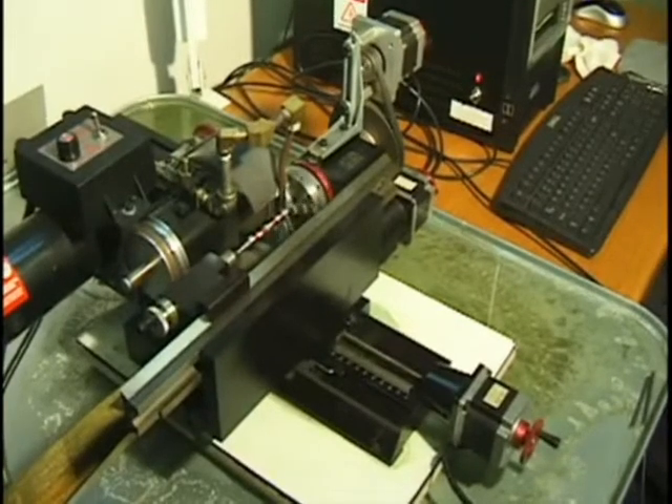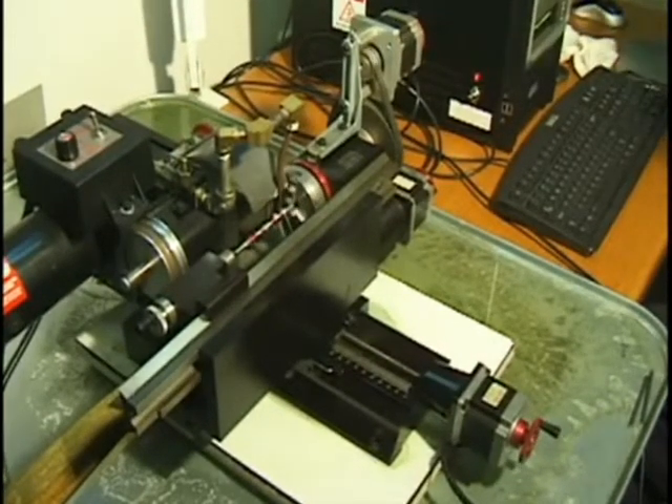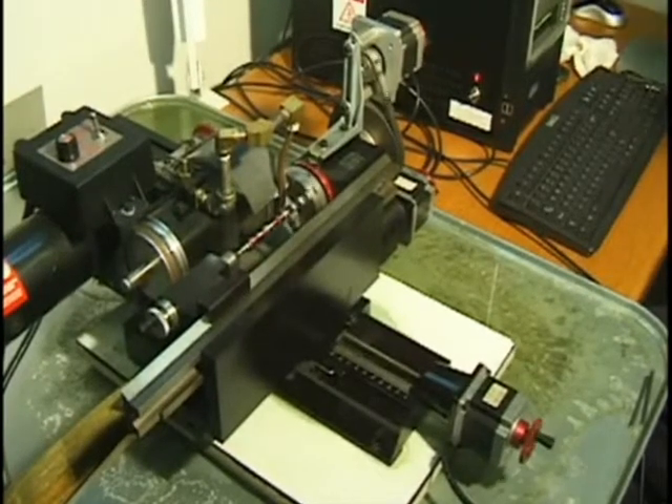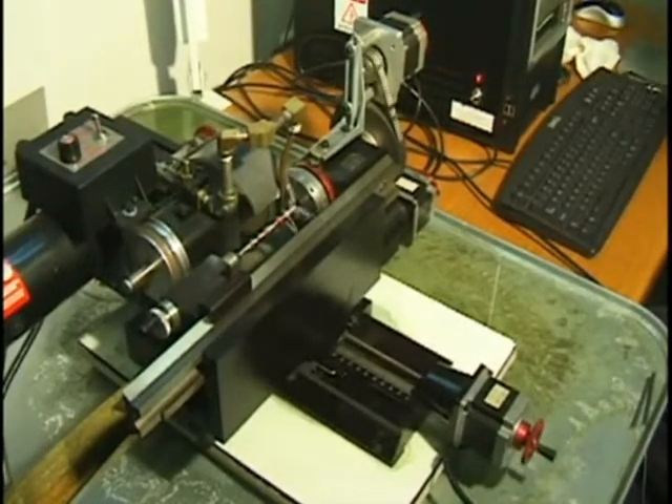The program itself will fill in a curved line because of the algorithm that was used. It's going to be a series of flat points if you do it that way, but if you do it at about every one or two degrees, it'll generate a nicely shaped cam.